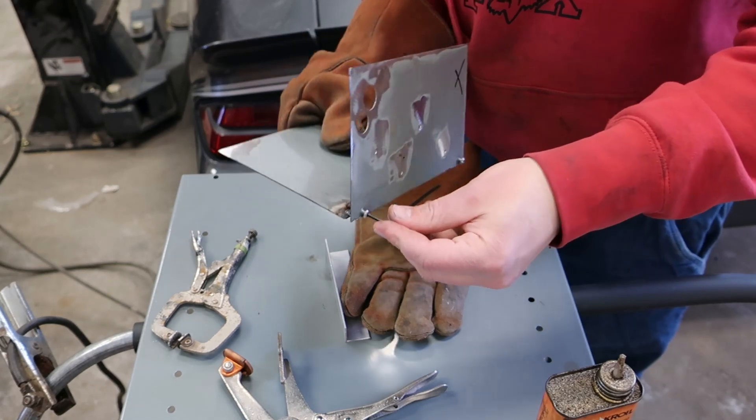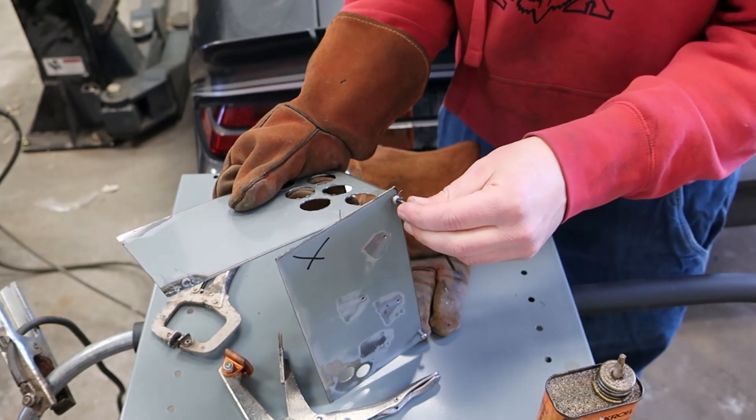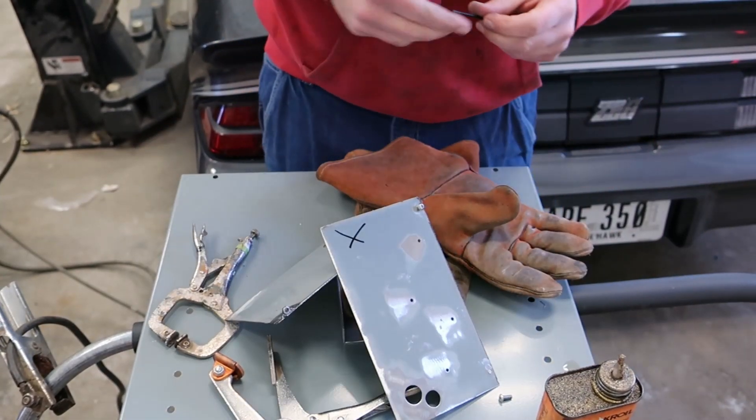It's hard to get those little nuts welded on, at least for me with a MIG. Just anti-seize the bolts and oil the stuff after you get done. I hope it comes apart.